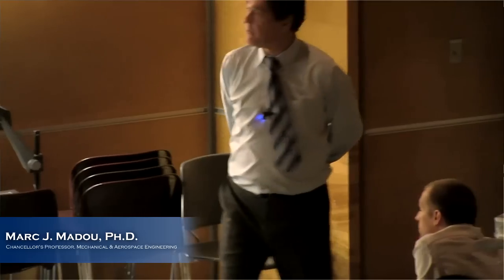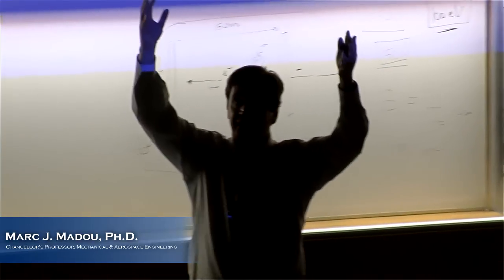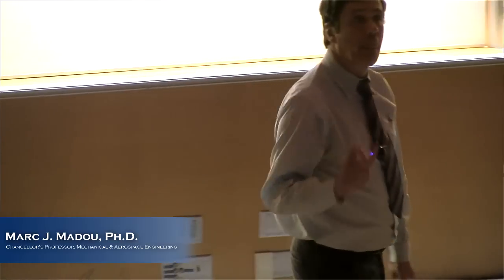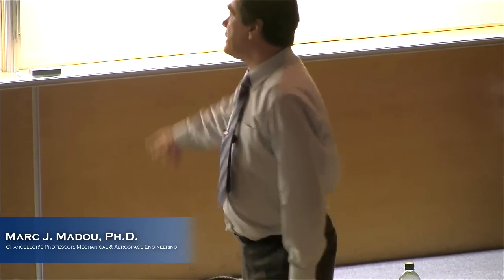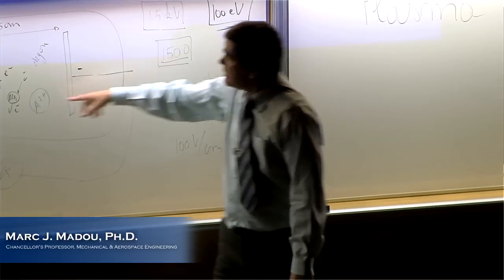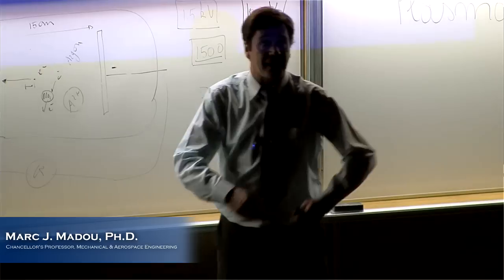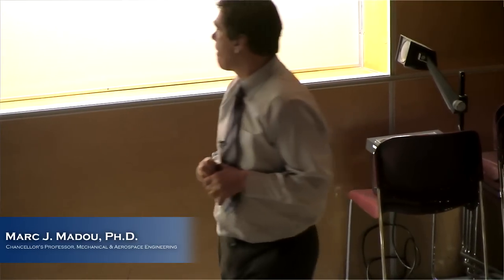Current increases, right. E equals IR. So there you go, it's Ohm's law, right? Yeah. So the current increases, R goes down, and so we go literally from almost infinite, from an insulator, to something of, you know, maybe 100. Sorry, yeah? So I'm saying voltage constant because it's a high voltage? Yes, your voltage source gives you 1.5 kilovolts. Right, and then in the beginning it drops over this big resistance. Then suddenly it's like you burst it open. The resistance goes from almost infinite to something like 100 to 200 ohms, very low.